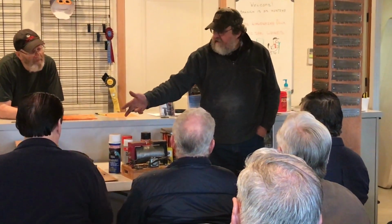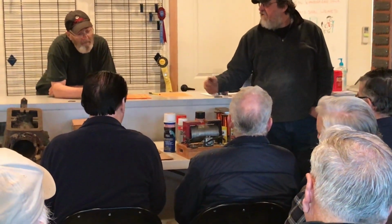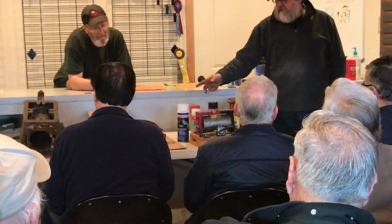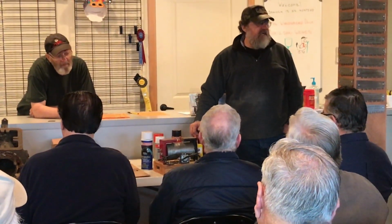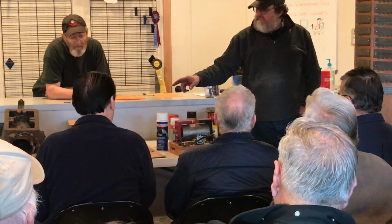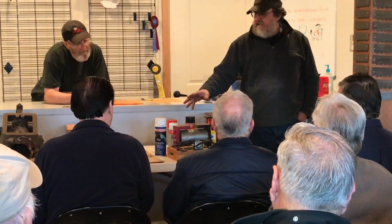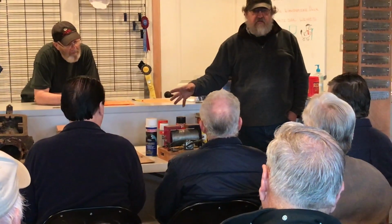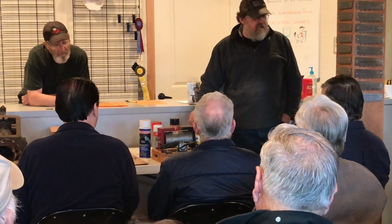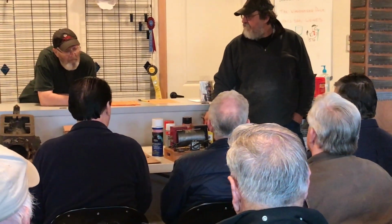With a head like this, I'll stick it in a tub and spray it. Because it's dry, you want to get it wet. I'll either soak it in kerosene or diesel, or I'll just walk by and spray it with this stuff on a daily basis for probably a month. After that, if they don't move with a little tapping, I'll build a fire in a barbecue, cover the entire head with briquettes, and just cook it, then let it cool down slowly, and then start oiling again, and then the valves will probably come out.